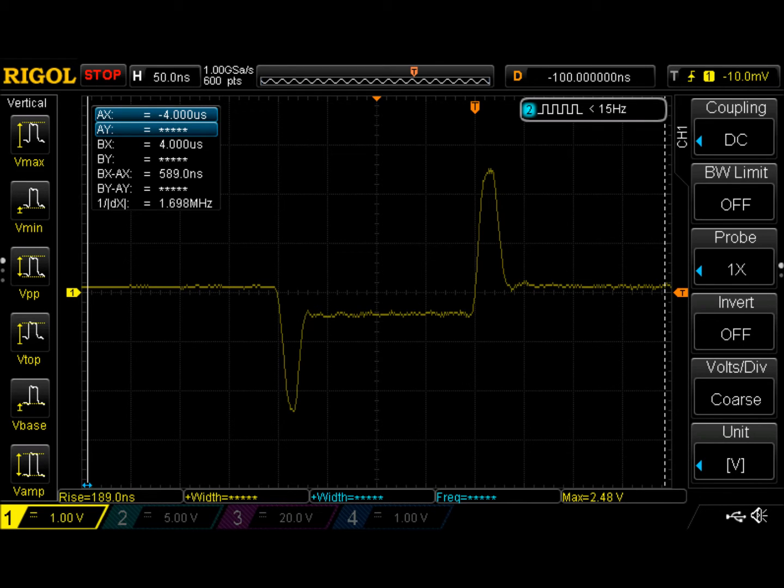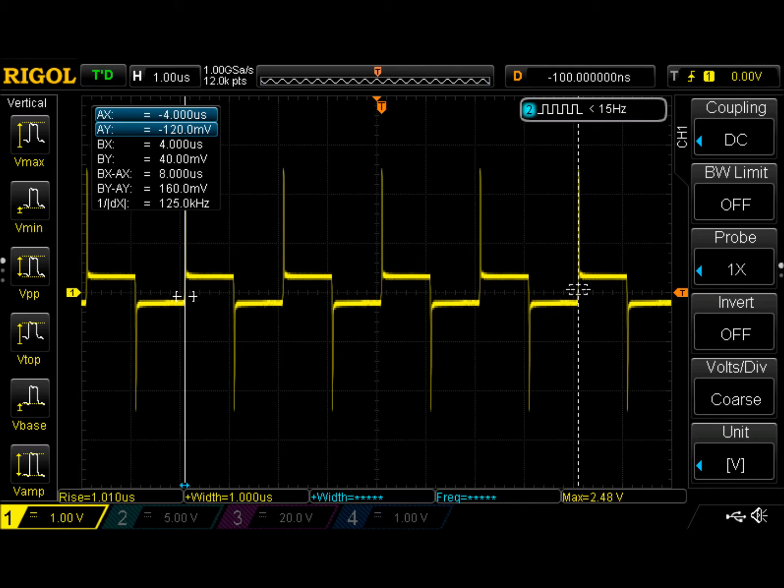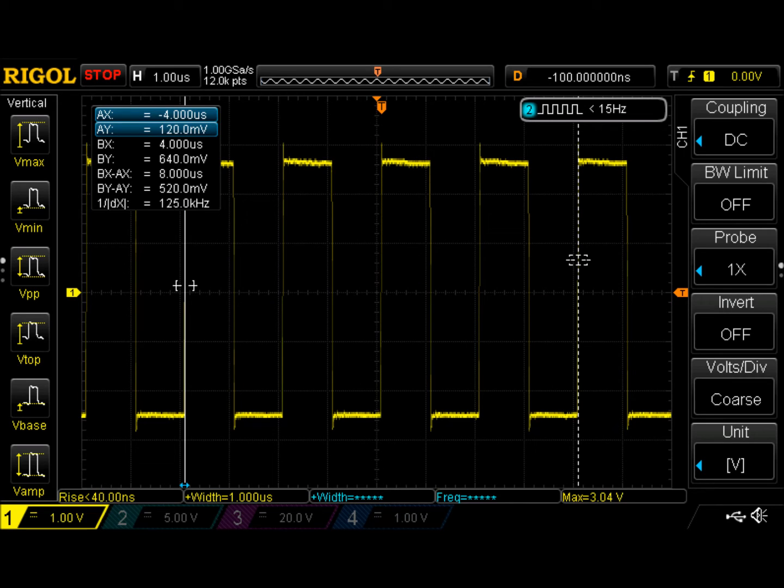Here's a screen capture of a 5 volt pulse — note it should be a half a volt total due to the 10:1 scaler. But the overshoot and undershoot at the beginning are really, really large, so you need to take a look at that next. Here the function generator is set to a square wave at 500 kHz and 5 volts with a 50% duty cycle. This is the input waveform that swings plus and minus 2.5 volts with respect to ground.